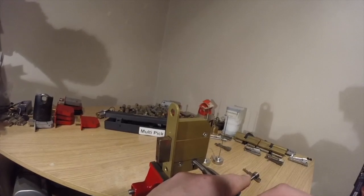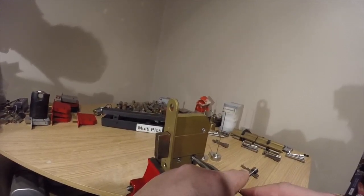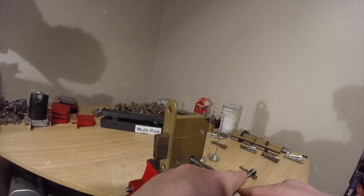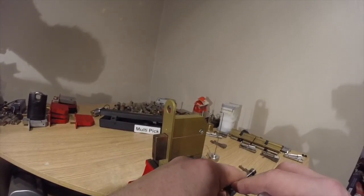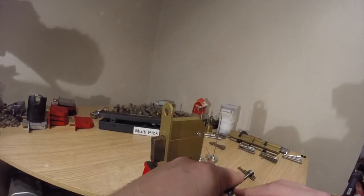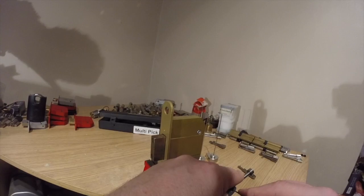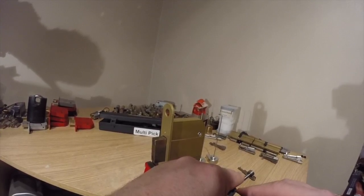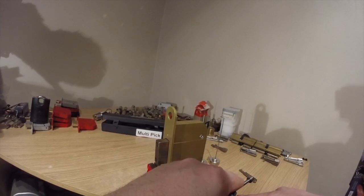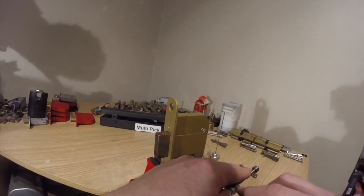Right, so that sounds like it's in its gate. We've got a low lever. I need to corkscrew underneath the low lift. There we go, a big anti-pick. So using it to my advantage, lever number 2 is binding. So that's where I've gone wrong. I think that was a high lift, so I haven't lifted that high enough where it's dropped down.